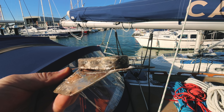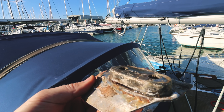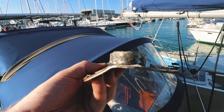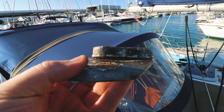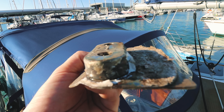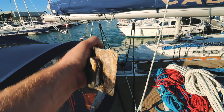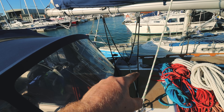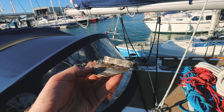That was the backing plate that went through the hull and as you can see, not only has it bent — where the core has weakened and started giving away — but it's split all the way along the side there. Where the force of the main sheet would have been yanking hard, the structural integrity of the core of the boat, the hull, is obviously not great in that spot.